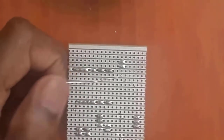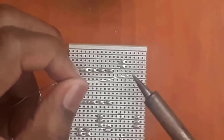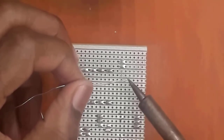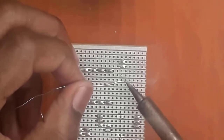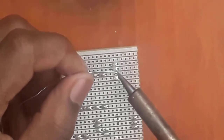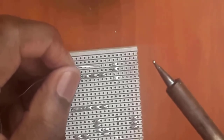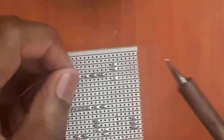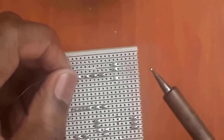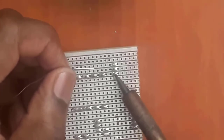Now, to avoid messing up the situation is, you must not let your solder stay too long, because what will happen is the heat will dry the flux. So the heat of your soldering iron will dry the flux. Now if you keep your soldering on for very long, what it does is it will suck all the flux out. As you can see, the smoke rising. So what happened is this solder here on this top here, it's melted, it's in the melting point, but there is no more flux in it. Therefore, if I try to apply it there, it doesn't stick very well.